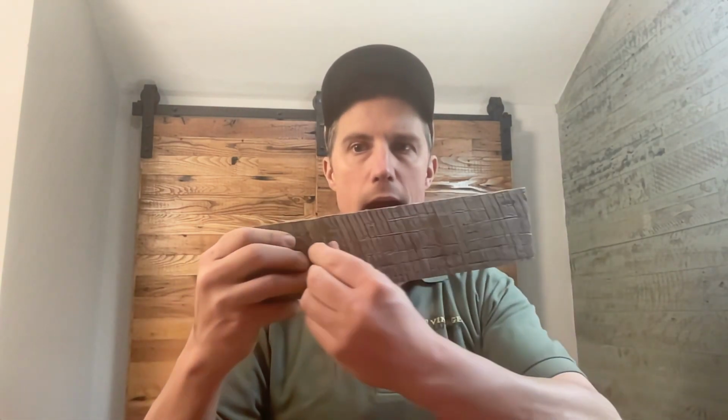Lengthwise, 1.5 inches. Our material is 3/8. Drywall is a 1/2 inch. So that's 7/8, let's call it. And so I use 1.5 inches to get it all the way into the studs. So you always want to try to mark your studs, and wherever you cross the stud, use the brad nailer there.